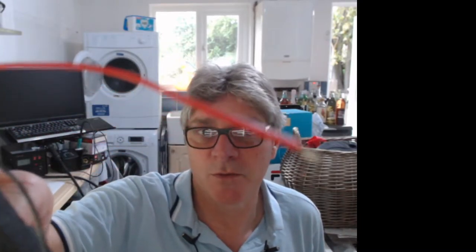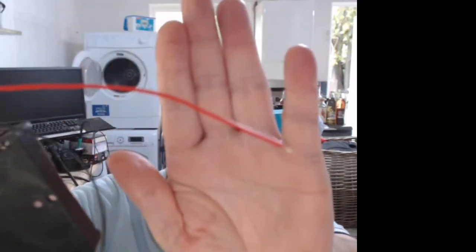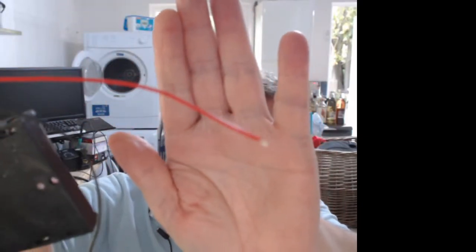Now, I've also tried something really small. I had these battery things, and they've got these really tiny cables at the end, and these do not get gripped properly. The trouble is they're so weak at the end that they won't separate the clamp. So we have to be a bit careful about what we support. For a start, I think the wires will need to be either solid core, or if they're multi-core, thick enough, heavy duty enough, and probably soldered in order to push through that V to get clamped. But otherwise, I think they're good size-wise.